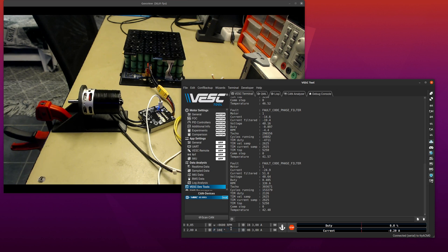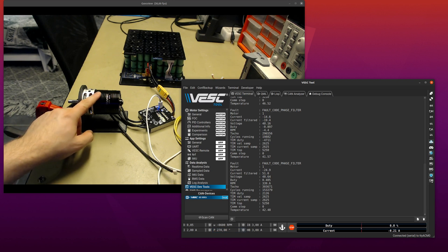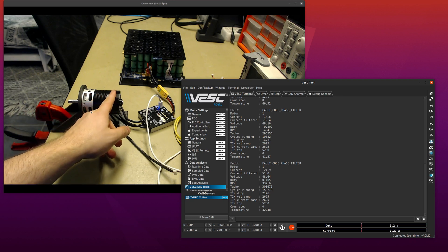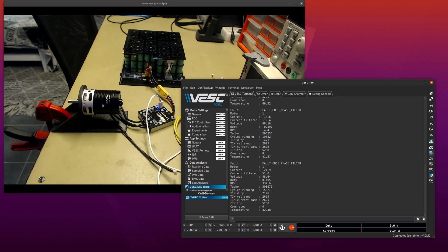Maybe 180... 270... 270 again. Now at 270 degrees you can see we have this reflection on the motor and the text that you can use as a reference — the N in the Trampa text kind of aligns with this edge of the reflection. So to demonstrate, I will run the motor to full speed — starting with some duty cycle control, changing direction, then go to position control, and we will hopefully see that it goes back to exactly this position.